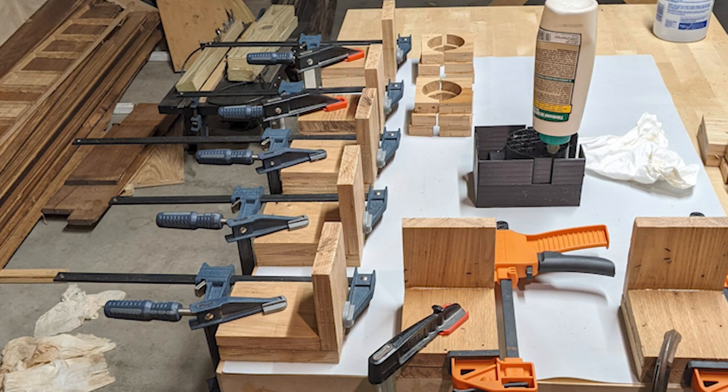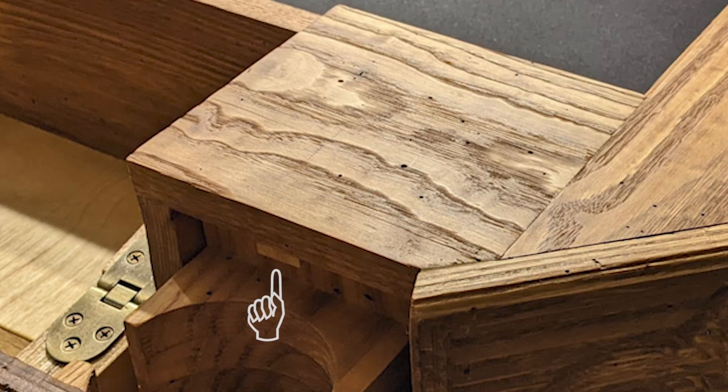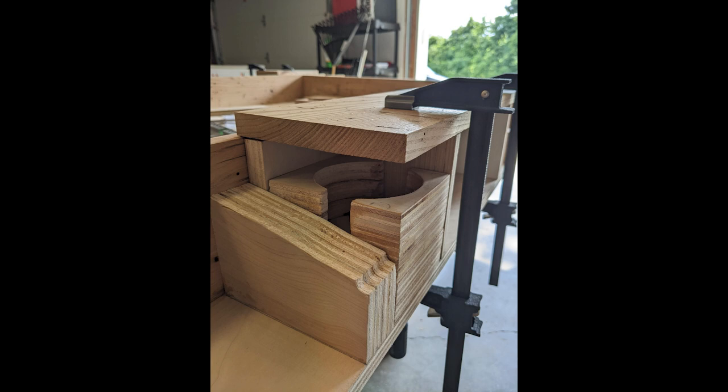Here's the best picture of the glue-up process for creating the cup holders. There's a base that goes all the way to the back, one more piece to raise it up slightly so drinks aren't too deep, and a back piece with a small stopper glued to the front so the cup holder stops at the back when pulled out. You can actually angle them a bit to pull them fully out. We used Johnson's paste wax on the bottom to make them slide in and out more easily.